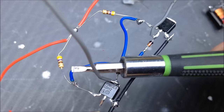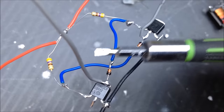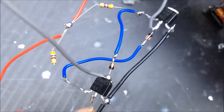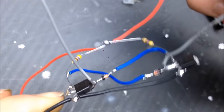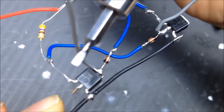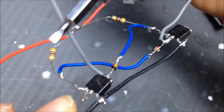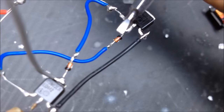And here are two resistors. They are 470 ohms and they're connected up to the positive. So take a good look at this. You'll also notice that I have some wires. So if you see that the gates of the MOSFETs, each one of the gates, so this right here is connected to both one of the resistors and one of the diodes on the other MOSFET gate.